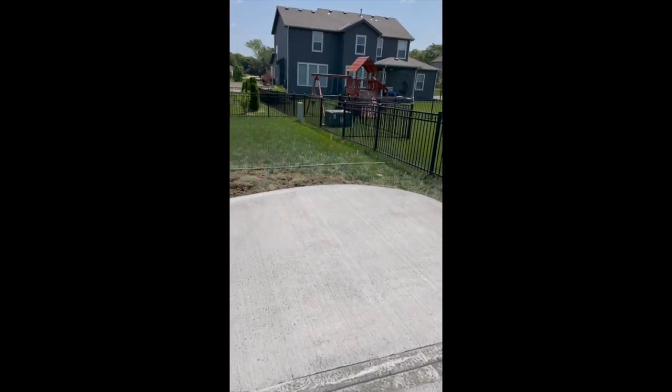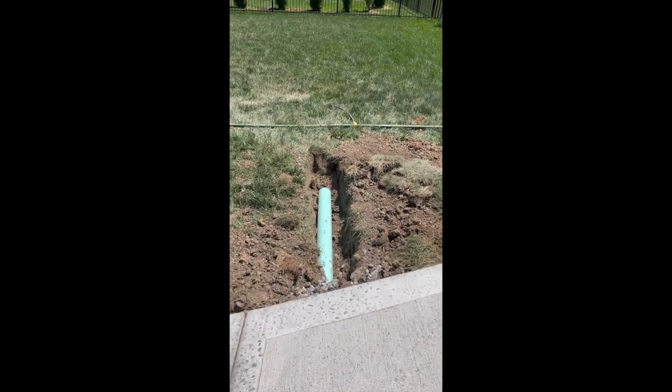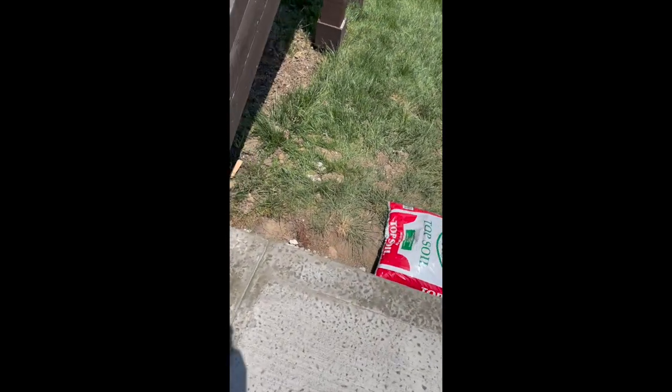Moving to the edge of the patio, we can see the other end of the PVC pipe from the downspout. That will need a pop-up drain once dirt is filled in around it. Speaking of dirt, I had to go to the hardware store again to pick up some bags of dirt, mainly due to a severe drop-off from the edge of the concrete, but also because we wanted to cover the stones to avoid any runoff.